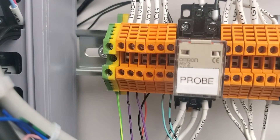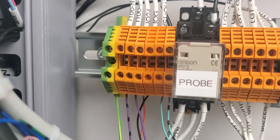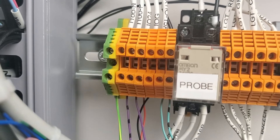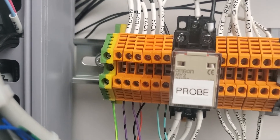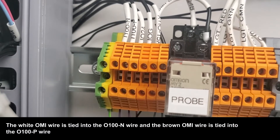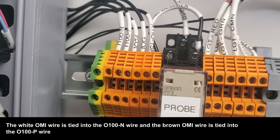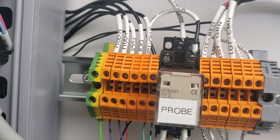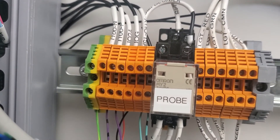Forgive the shaky cam — it's hard to get in here. Looking at the wires from our OMI from left to right: we have ground connected to a ground terminal block, then purple and black stripe, purple/red/black, teal, and teal and black. You can see the labels for each of those wires. The far right one is just a jumper for the OMI black and blue, which goes to our spindle probe.